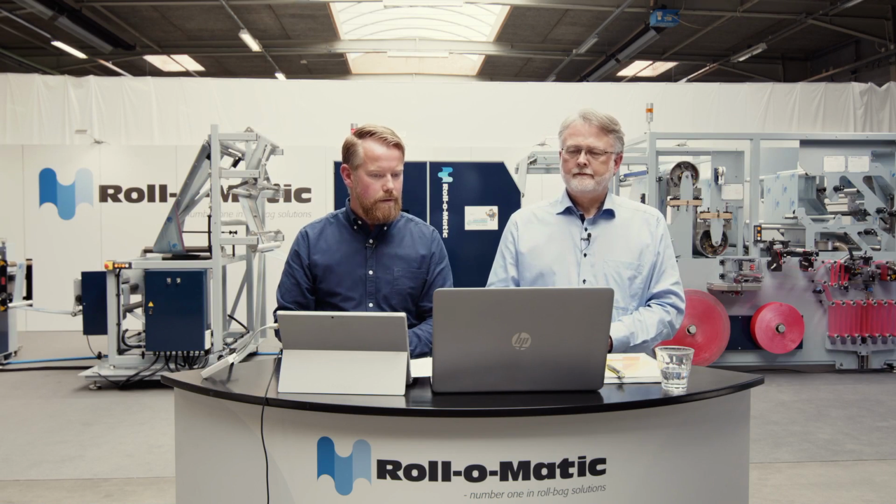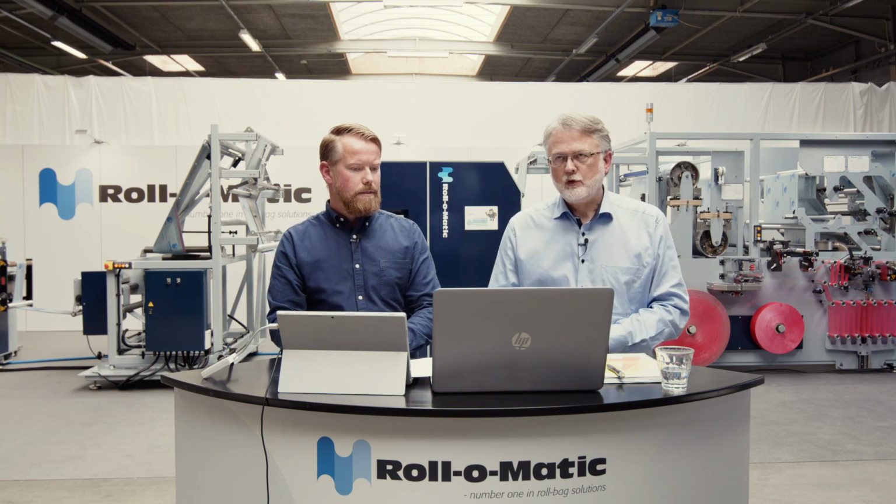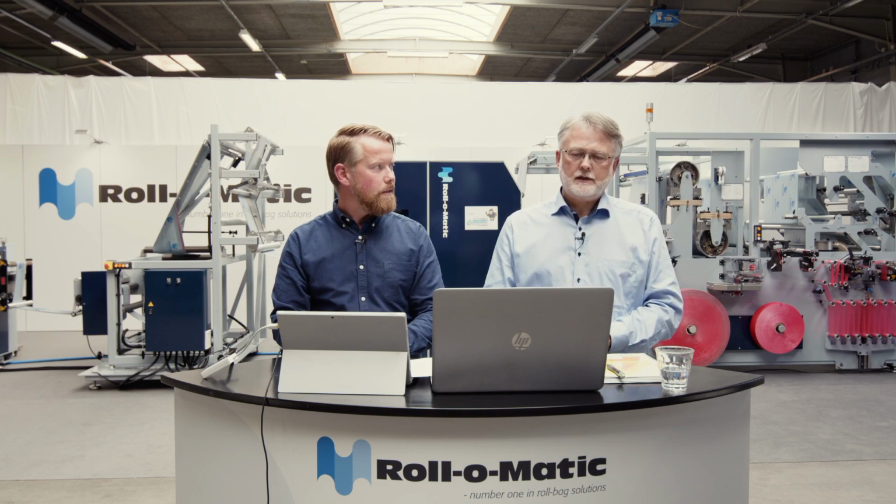Next question: how does our system handle variations in film gauge? Well, too much variation in film gauge is of course always a challenge. But our system, where we have heated sealing bars from both sides and a long dwell time, copes very well with normal variations in film gauge. So it's not so sensitive to that.